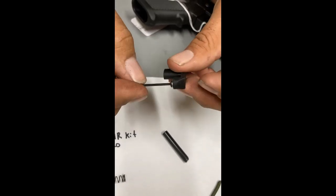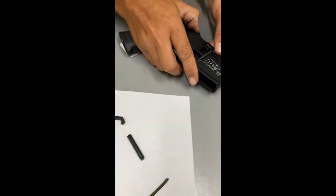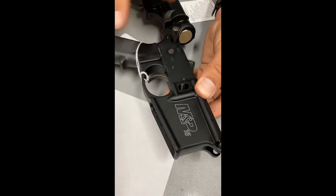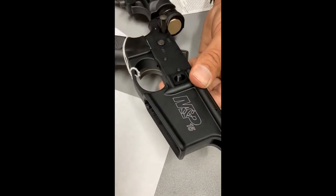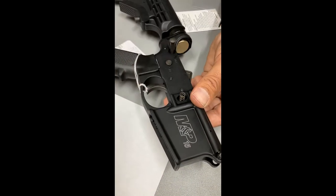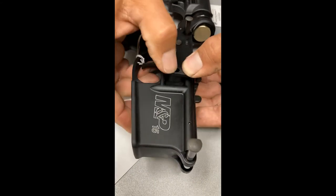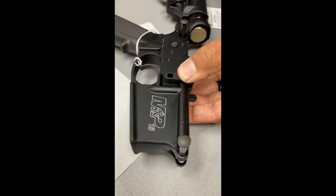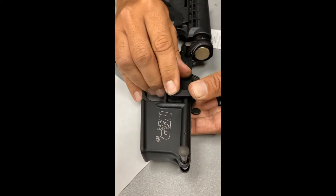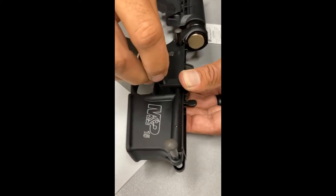Screw it down — it doesn't have to be super tight; when it's installed it can't go anywhere. Set that down, get your rifle receiver. You're going to put your mag catch — that comes with the rifle receiver; the mag catch is not part of the Patriot release kit. You're going to take the spring, which we do supply, and drop it in there. Then put the body of the Patriot on top of that, pinching from the back and the front. Take the castle nut with the castle up and drop it into that hole, then use the wonder wrench which we provide to start that.